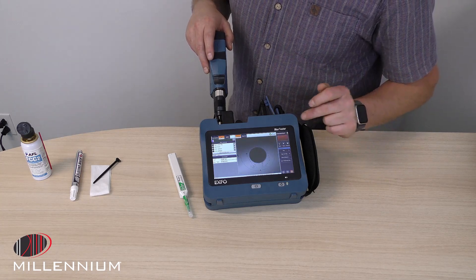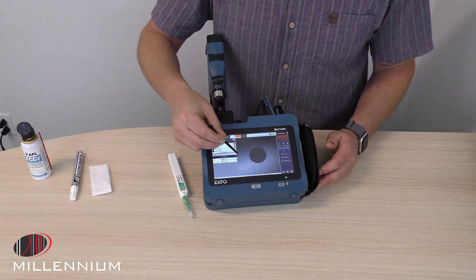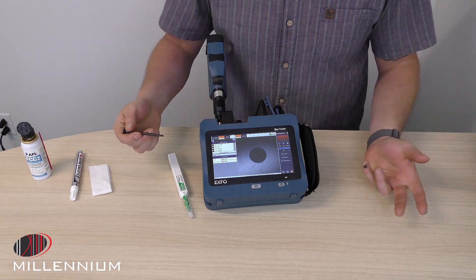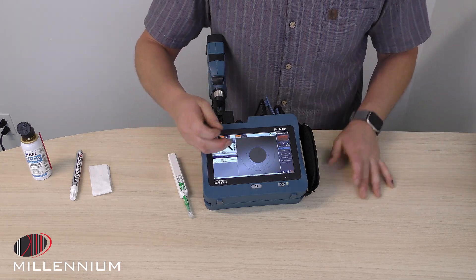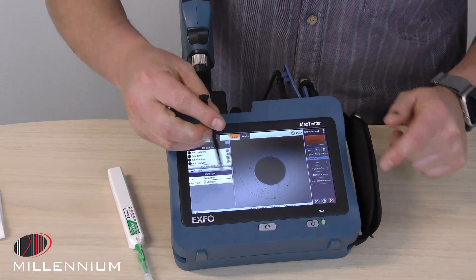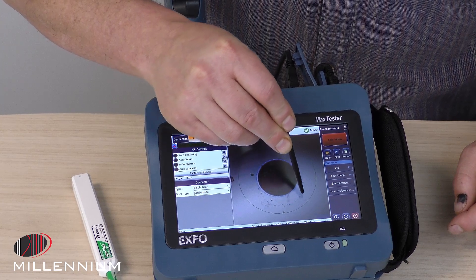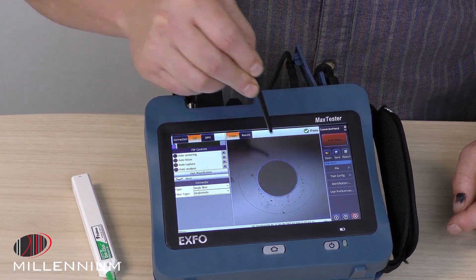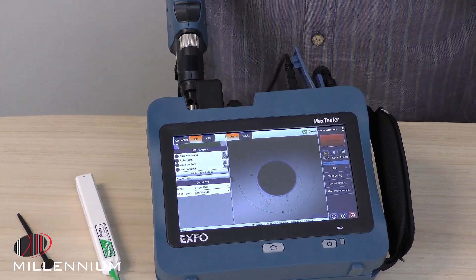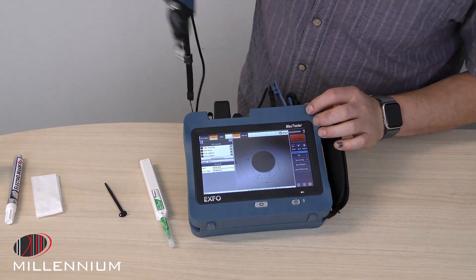This connector looks like it's going to fail — oh, it passed. It's kind of dirty; we can see some dust and debris. These big chunks out on the edges — that's okay, we don't really care about that because the core is smack dab in the middle where our light is transmitting. What's cool about this is I can tell somebody connected a dirty connector to this while it was out on rent. We've got these green dots making a light circle — that's much like putting your thumb on someone's glass window and stepping back to see your thumbprint. We're seeing a thumbprint of a dirty connector.